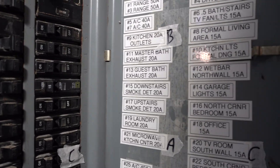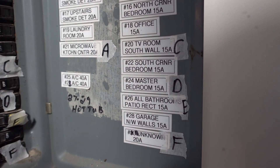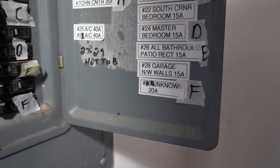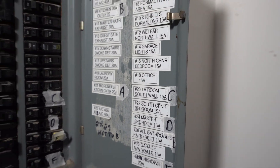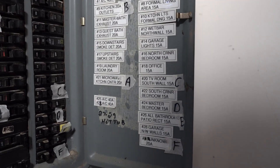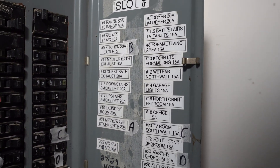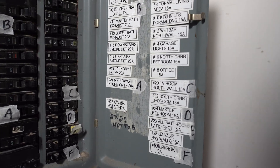On the 20 amp side, it's our kitchen outlets. Then some plugs in the den, master bedroom, and bathroom. This unknown plug is actually in the garage and outside — but that is six circuits. I've marked them on the breakers themselves and on this list. With the old house, things marked here are not necessarily what's actually powered by those breakers, so you definitely want to go through and double check that what you think you're going to be working on is actually what will be worked on.